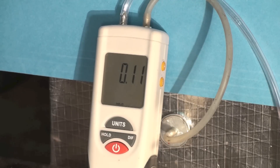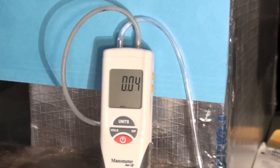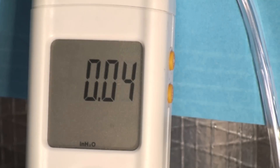It's got an electronic air cleaner in it, so we're testing it clean. Now we're going to try an El Cheapo filter — I'll show you how thin this fiberglass filter is. Let's see what kind of pressure drop it has. Okay, here we're set up with the El Cheapo filter, same setup, and we're reading four one-hundredths of an inch water column.